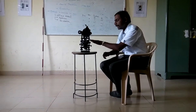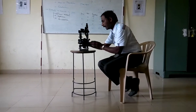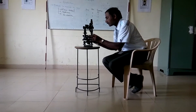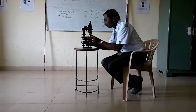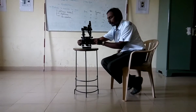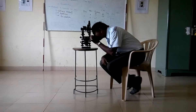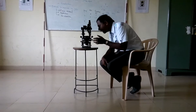Both verniers C and D are set to 0°0', and A and B are also set to 0°0'. Both the upper and lower clamps will be loose, so the readings will be equal. I will set 0°0' and it should match 360°, which is nothing but 0°. Using the upper tangent screw, I will bisect the image until the reading is exactly 0°0' — yes, it is matched.